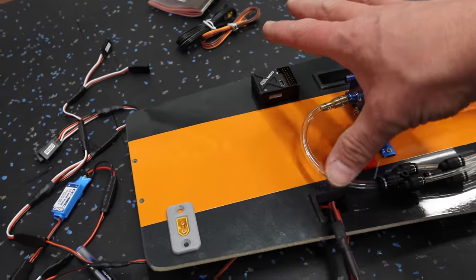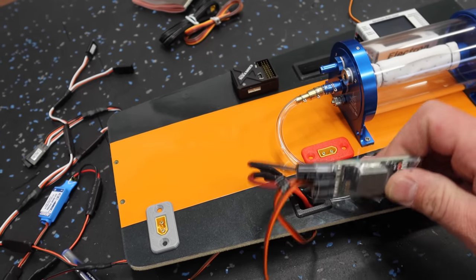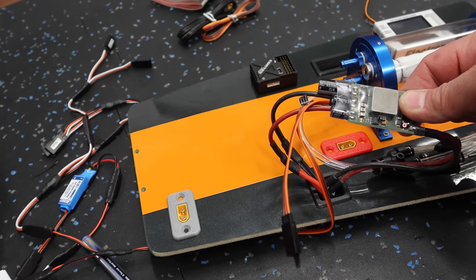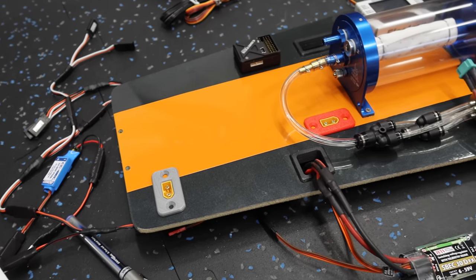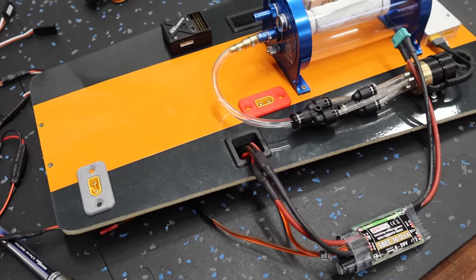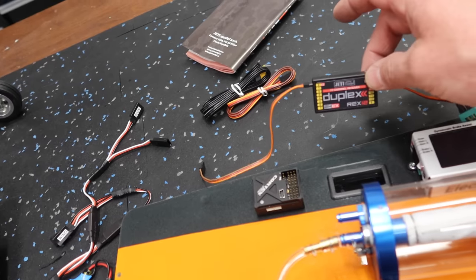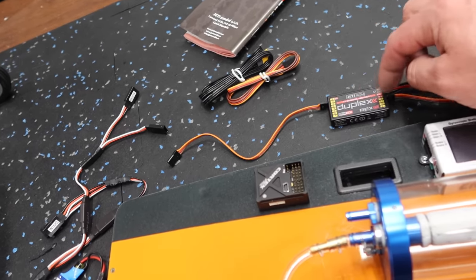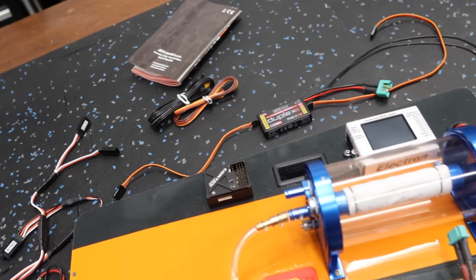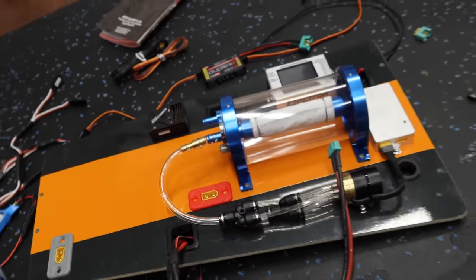The last thing you want is having to pull this tray out and having to disconnect a bunch of things. So this S-Spec, as an example, will be mounted to the side of the fuselage with Velcro, but if you take the tray out, you un-Velcro the S-Spec, and it basically all comes with everything. There might be one plug for the M-Speed sensor, which is gonna come off. So not a big deal at all. And then our Rex-12 is gonna go on the other side. So if we do ever need to take this off, we just gotta take the plugs out of the Rex-12, that can stay mounted, and the tray comes off. So as serviceable as possible, I don't wanna be having to disconnect power leads and things like that, so that is the mentality behind everything we've done so far.